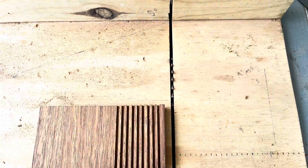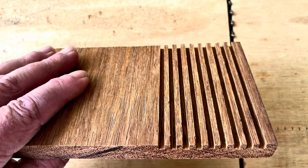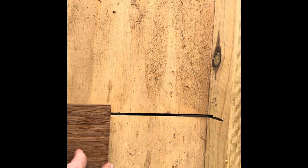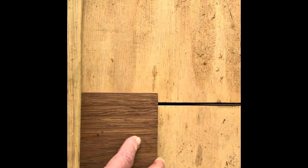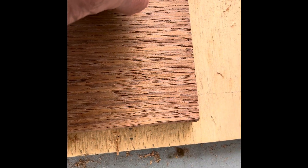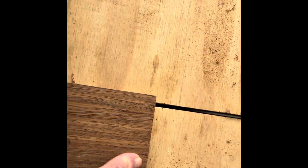Just a quick short today showing the new side panels for the upcoming 2.1 amplifier Mark 3. It's done on my little sled on my table and the cuts are 3mm deep, spaced at 7mm side to side, so there's a 4mm louver. I'm pretty happy with the way this has turned out — it was my first try and I think it looks great. I'm going to do the opposite side now.